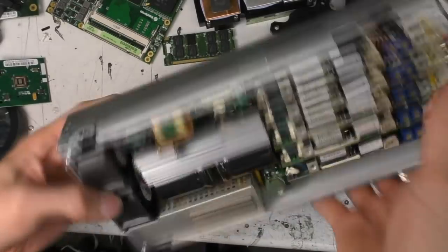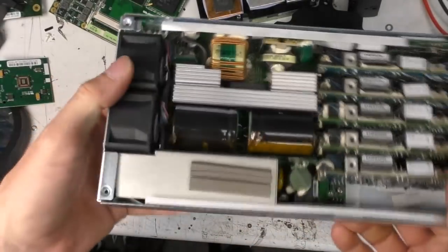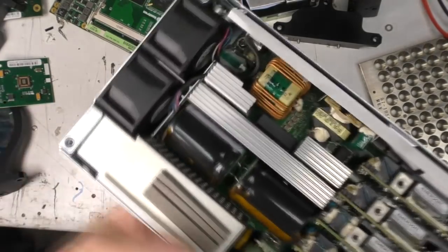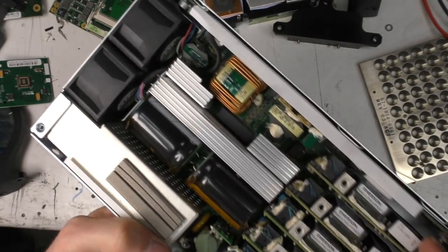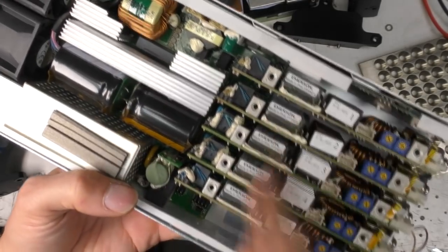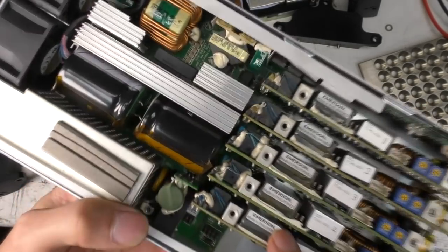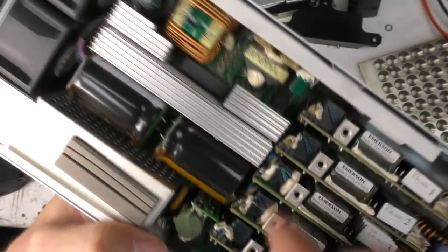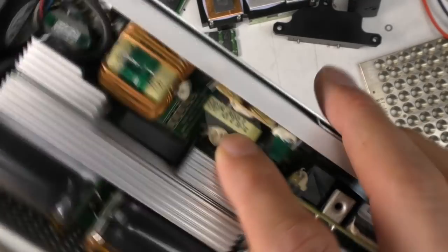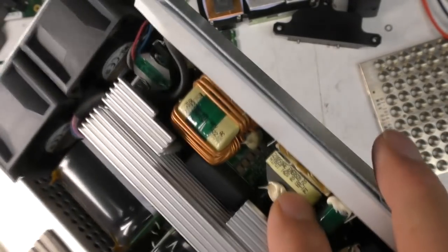And just lastly, a quick look at this power supply. This is a 1200 watt power supply in a very compact case. 2 fairly powerful fans here. And like most other modular power supplies, you've got a common front end module board, and then various modules for the various different output voltages. And there's PCBs in all directions. There's some funky magnetics going on there.